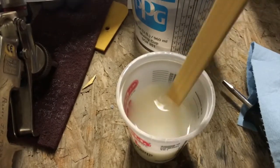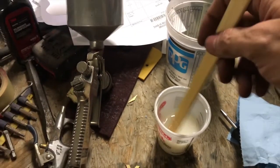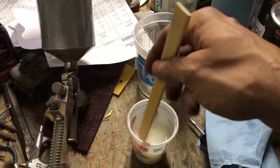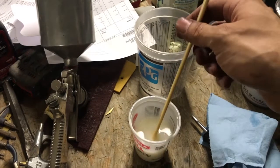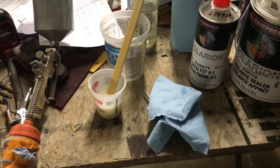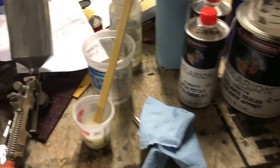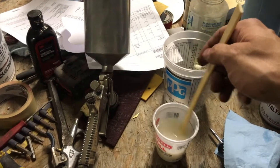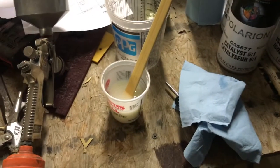And it's almost exactly what I wanted, kind of a resin-based clear for the piano, because pianos have really hard, thick, clear coats on them. It's not like automotive, where you can use car paint type clear coat on wood once you've sealed it good, but it's not made for it. This is something that's actually meant to go over wood, so I'm really excited about this. So we'll try it out.